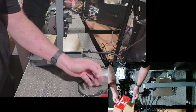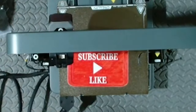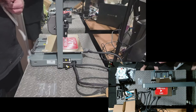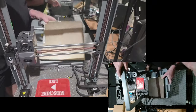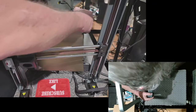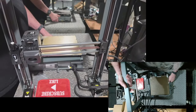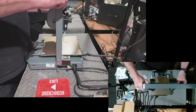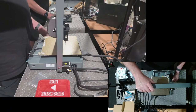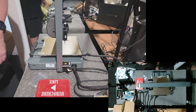The gantry basically fits in these areas here - the sides and the front, away from the cable but where the display goes. I'll put the gantry on first - that's the main thing - make sure it's facing forward. Before you put on the gantry, make sure that your power switch is set to the right voltage. You don't want to blow your motherboard up by having it on the wrong voltage. That's on the left hand side as you're looking at the front.